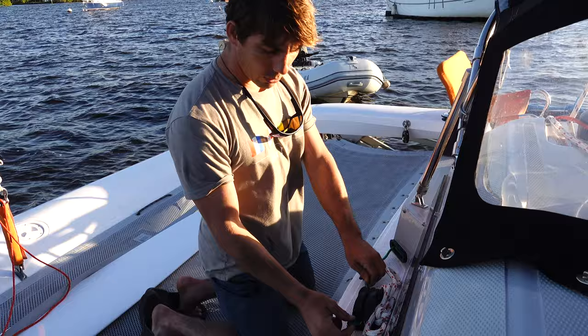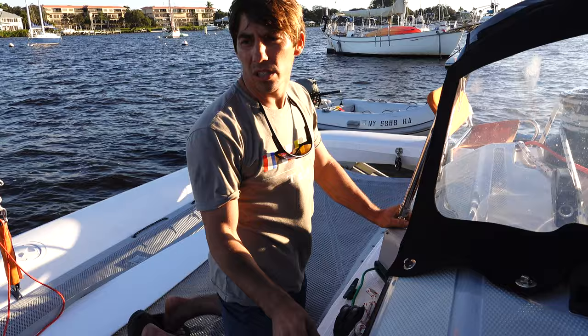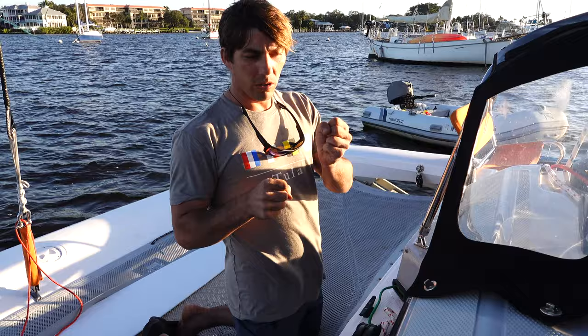So if you were gonna rig this screecher, you'd hook up the tack to the little point on the bowsprit that I showed you before. You raise it with the screecher halyard, which is this red one right here. And then it's on a continuous furler. So it's up there, raised on this furler. The furling line just kind of runs back here.